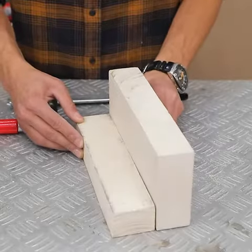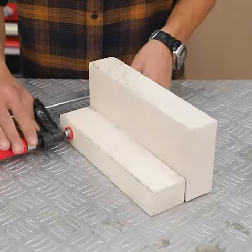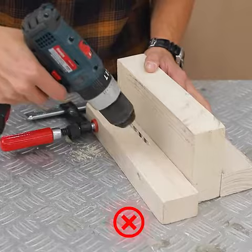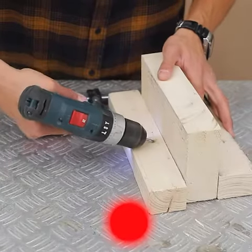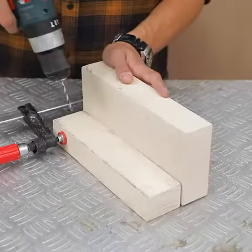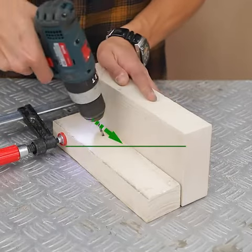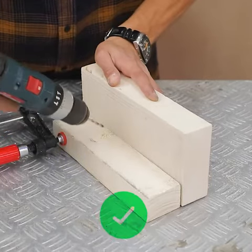Angle drilling can be a problematic issue. If you start drilling at an angle from the very beginning, the drill bit might slide over the surface, and even if it goes through, it may cause problems. It is better to place your drill vertically and let it dig into the material and get set. Then slowly tilt your tool down and drive the angle.